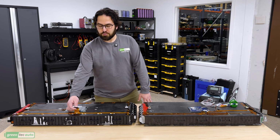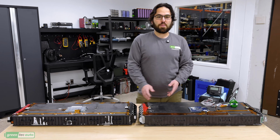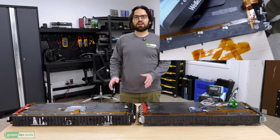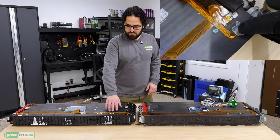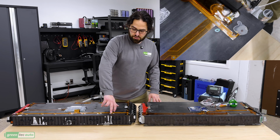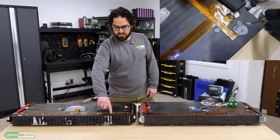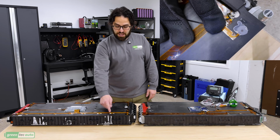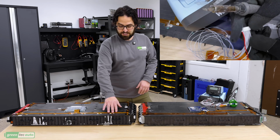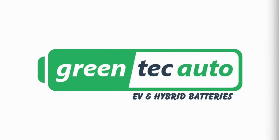Ideally, you'd want to find the other end of the plug that has better legs that you can solder wires onto. Or the simplest and most reliable way is just to remove the ribbon cable altogether and use the wires that came with your BMS kit and go directly to each cell group itself. Each cell has a nickel tab that's coming about 3/4 of an inch out of the module, and then there's some silicone around it, so you can solder pretty easily right to that nickel strip, and you're not soldering directly onto a cell, so there's no heat getting transferred in there or anything dangerous like that at all. And then there's also no plugs or anything that can wiggle loose or corrode over time.